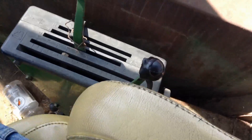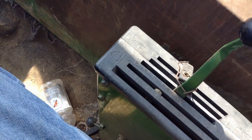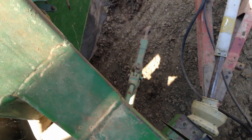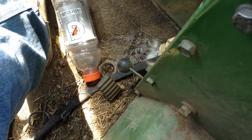Over here we have the hydraulics — this tractor only has one hydraulic SCV. And then this handle is for the three-point hitch in the back: push it down to lower, pull it back to lift when the engine is running. For locking the back wheels, you push down on this pedal and it'll lock the back wheels together to give you more traction.